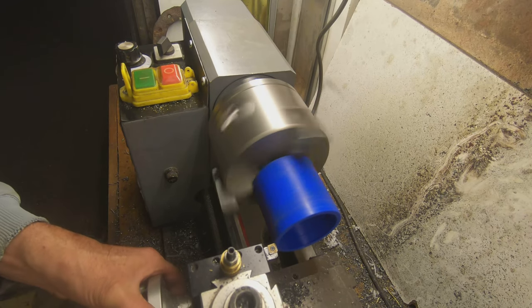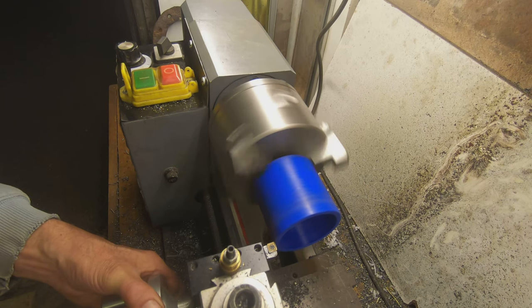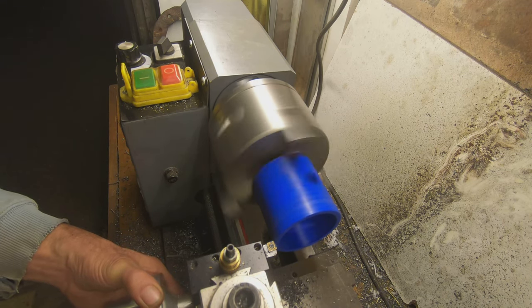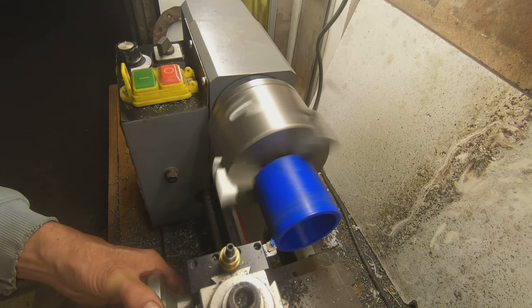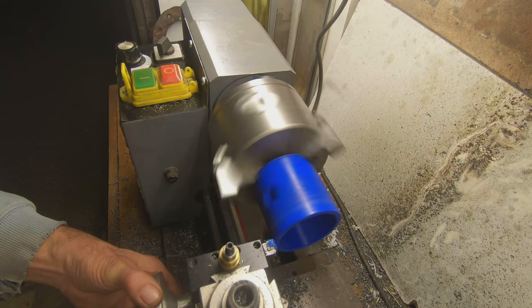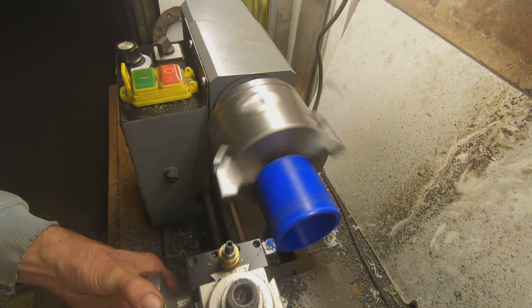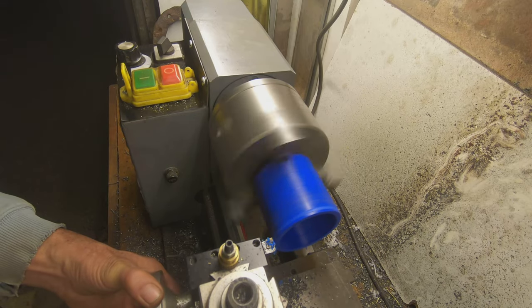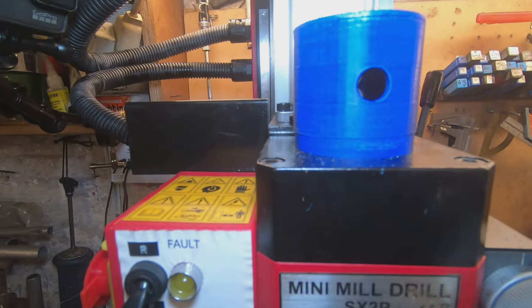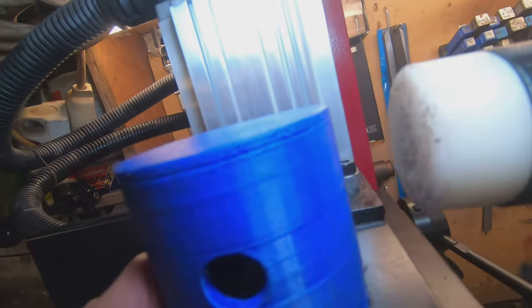The sensor itself fits to the drawbar cap. Most people drill a hole but I didn't want to do that. I hunted down a 3D model that some kind soul posted on Thingiverse with the hole pre-formed at the right height, and what I'm doing here is turning it down to fit. There's the cap on now.